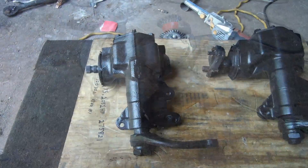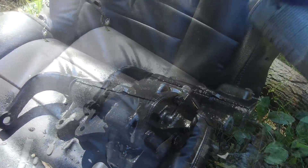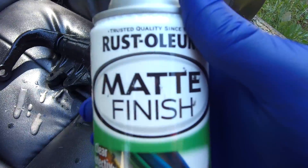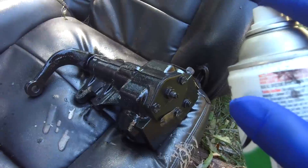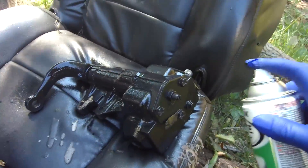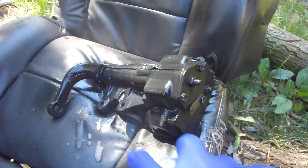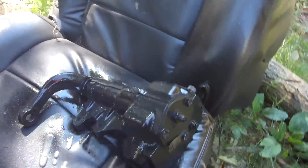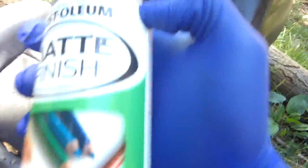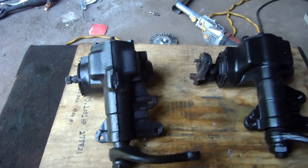Right after we got those things cleaned up, we painted them. I put a couple layers on already — $3 paint with multiple uses. Now here's the thing: it is wet right now and we're going to put some Rust-Oleum Matte Finish on there. It will not chemically change anything — you can use these two things together and it just doesn't react. All you're going to get is a nice finish right over it. I didn't even let it dry; I'm just letting you guys see that it doesn't crinkle up. You can mix the two together, which is great. The cheap paint with the good clear worked out nice.